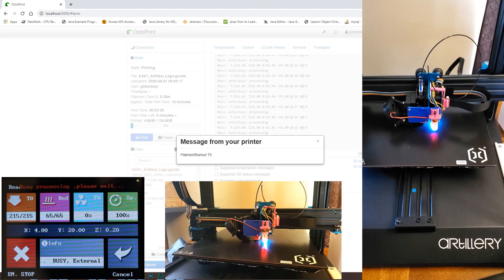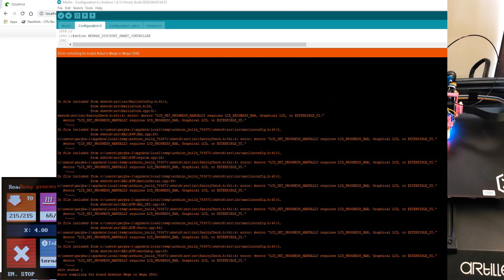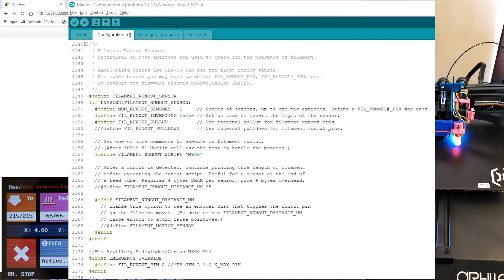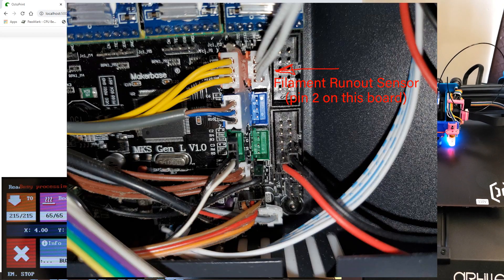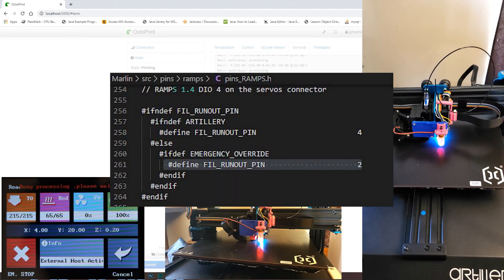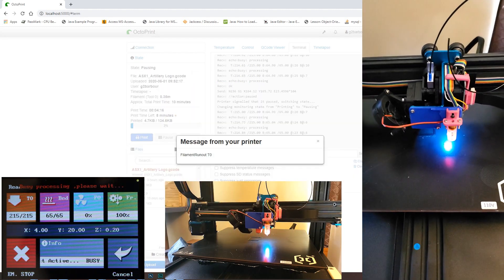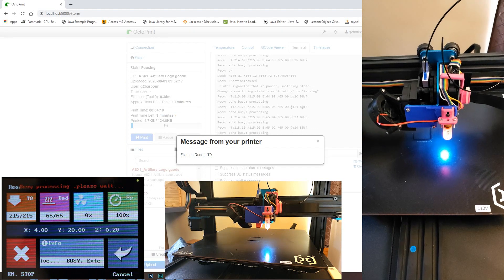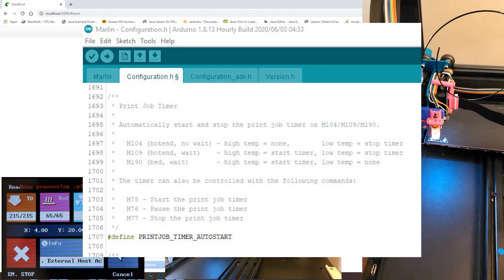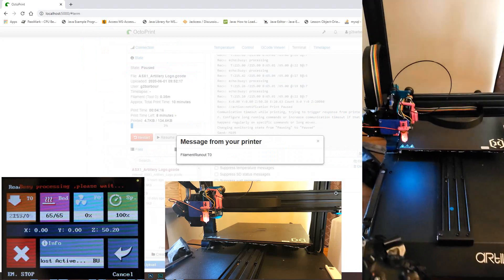The reason to enable an LCD controller is that Marlin requires it to activate the family of features needed to run M600 and filament changes. Also in Configuration.h, I enabled Filament Runout Sensor. Because I was moving the filament runout sensor from the TFT to the main board, I chose the X max position, which turned out to be pin 2. So I went into pins_ramps.h and changed the Filament Runout Pin from 4 to 2. The last thing I enabled in Configuration.h was Print Job Timer Auto Start, which allows the TFT to activate the filament runout sensor in Marlin, which is disabled unless the print timer is running.